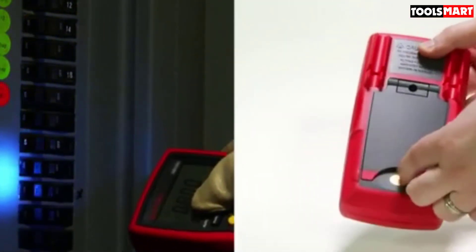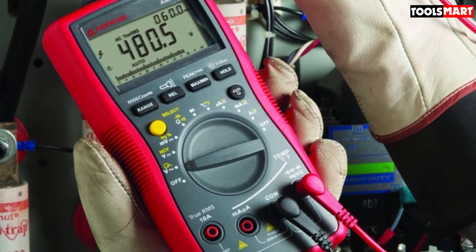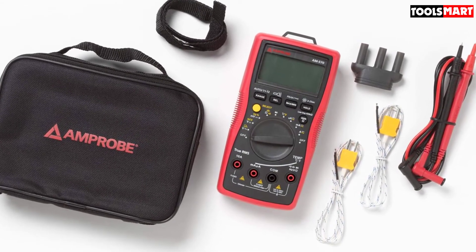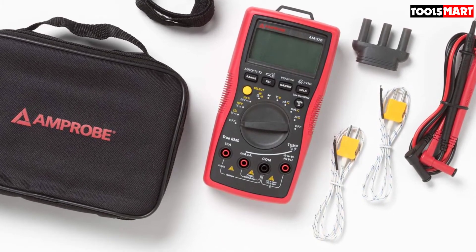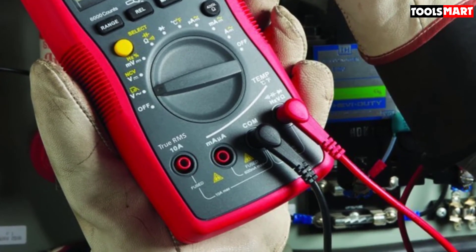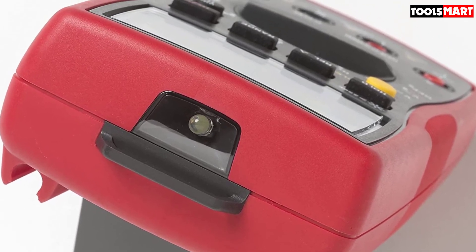It can be used on systems of voltage up to 1000V. While testing electrical or electronic circuits, it gives low impedance input to circuits under test. General multimeters with high impedance can affect the performance of circuits being tested, but low impedance mode prevents stray and ghost voltages during the test. It has a compact outer body built with rugged material. A built-in back stand helps you place it upright on your work table. There's also a flashlight on top of the body for use in low-light areas. This multimeter has CAT-level safety certifications — rated CAT4 up to 600V and CAT3 up to 1000V. CAT4 rating means it has extra protection against transient voltages.